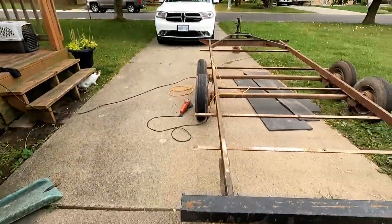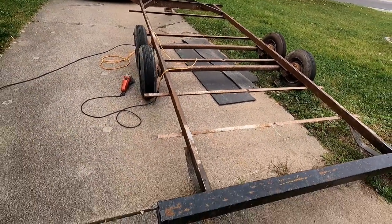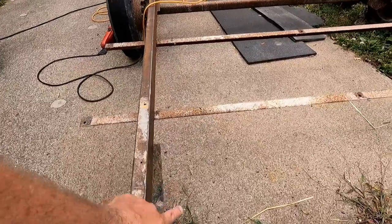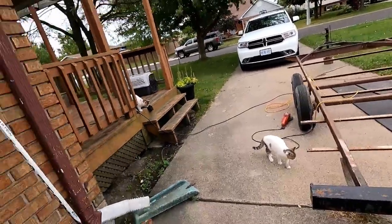We got most of it sanded down — the main frame rails are sanded down. And this is the point where I say: change the plans. I was gonna cut all this angle iron off, but I thought it's not hurting anything, so why not just sand it down and paint it? If anything it's adding strength because I'm gonna put some tubing in between all the way along to stiffen it up. Makes sense to me. We're gonna do a little more sanding and then break out the paint. We're not ready to paint the whole thing yet, but we'll put paint on it so it doesn't rust. Wherever I'm gonna weld, I'll grind the paint off, weld it, and paint it back up. Two steps forward, one step back — kind of how we roll.